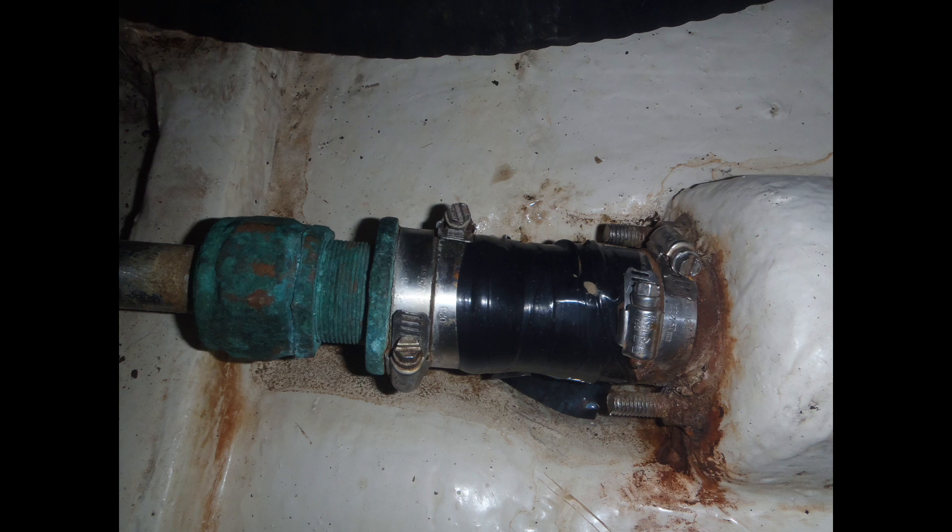What we're looking at here is a shaft log hose on an older mid-sized sailboat. The shaft log hose connects the stern tube — a fiberglass tube that exits through the vessel's hull — to the stuffing box. It's a section of rubber hose that connects those two together. The stuffing box, or shaft gland, keeps water from entering the boat. A hose has a limited lifespan; around 10 years, you want to start replacing hoses — especially those on fittings below the waterline, seacocks, shaft log hoses, and stuff like that.